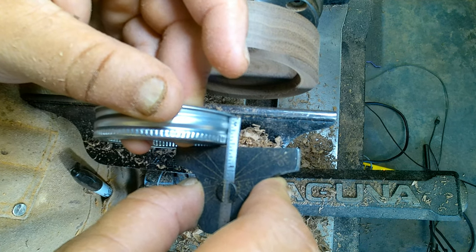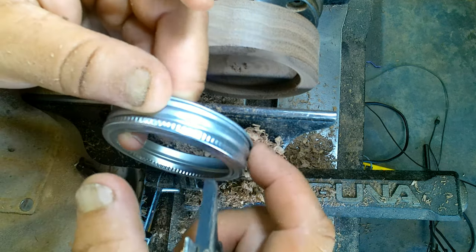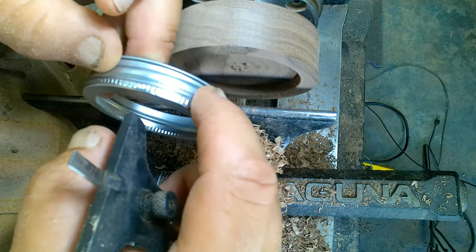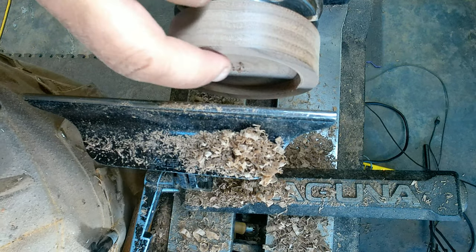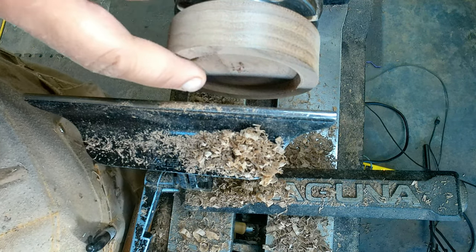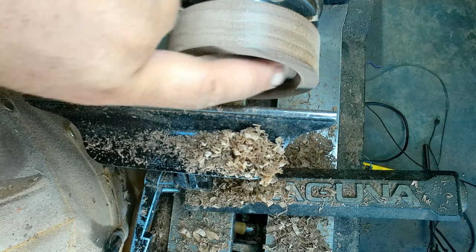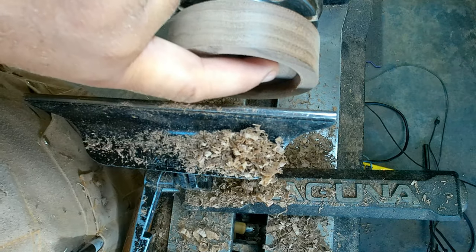It's a tiny bit over a half an inch there. 1/64th over, maybe a 32nd. It can be a little bit deeper. Again, this rim catching, that's kind of the trick to this. So we can make it a little bit deeper, and I see they're not quite level here, so I'm gonna clean that up. At this point, it doesn't matter if I lose this line because I'm slowly gonna creep out to that anyway. So I'll clean this face up and get this depth.